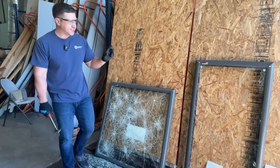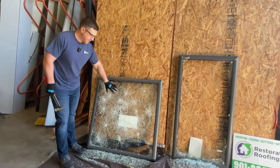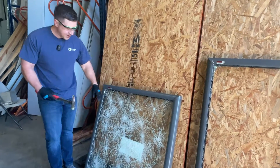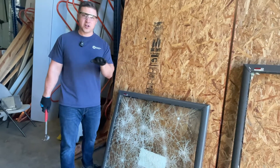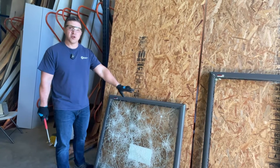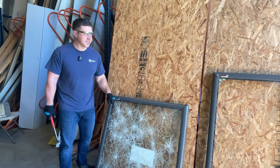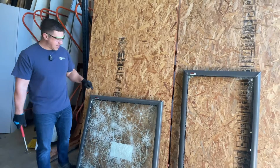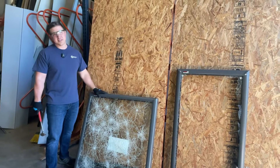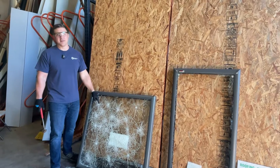I think that proves the difference between laminated and tempered glass. Whereas the tempered glass, after a couple of hits, turns into nothing and anything can get through — if this laminated skylight gets impacted, that top layer of tempered glass can break, but the laminated glass should hold it all up there. This can still leak once that top layer of glass is broken, and the skylight has to be replaced. But for the safety factor alone, this is a lot safer. That is why at Restoration Roofing and Mid-South Skylights, this is the only type we will install. We will never install a tempered glass skylight — it's just not worth it. The little bit more money that you spend makes this 10 times better. Thanks for watching.